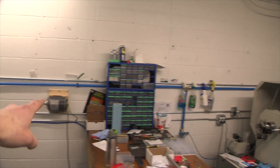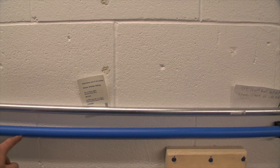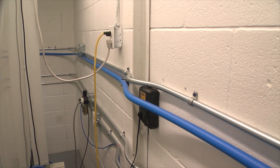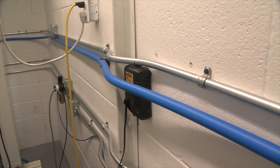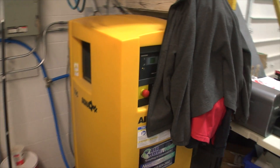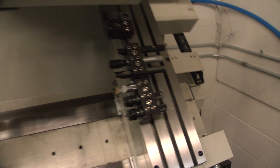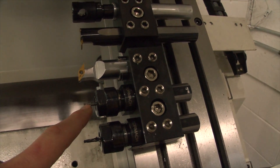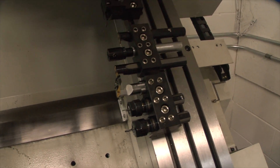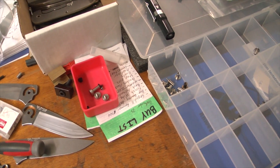He did the blue rapid air line. I didn't realize — super cool — that because it has an aluminum lining inside, you can actually form and shape it basically by hand, for instance to go around structural steel. I'm excited to look into that for our shop. He also has a much nicer rotary screw compressor. We've been nerding out over his Tormach lathe and the 440 ID threading he's been doing. He made a video on making his own tool holder for a V series insert — he does great work with that lathe.